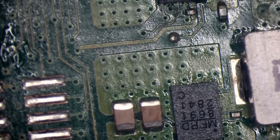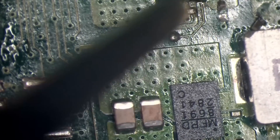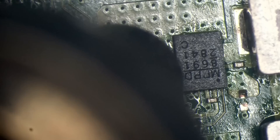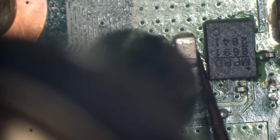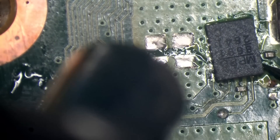So now I'll remove the MOSFET. But there's still some burnt components. I'm going to remove all of these caps first — they come off really, really easily. All of these caps are going to need replacing anyway. It is probably going to be one of the MOSFETs that's bad. It looks like someone's already replaced the MOSFETs — let's see what the deal is.